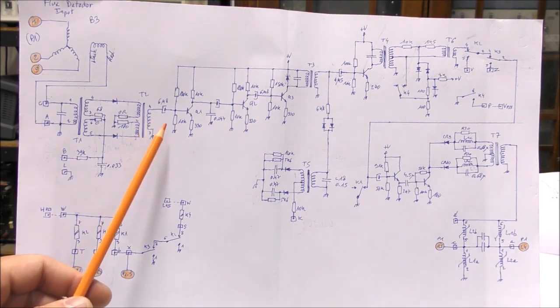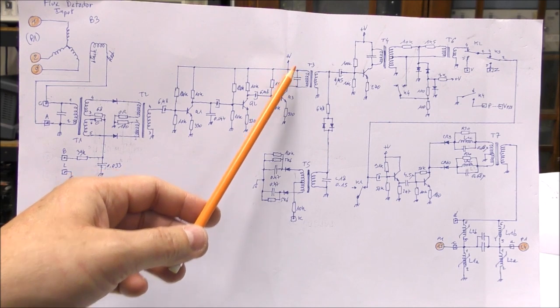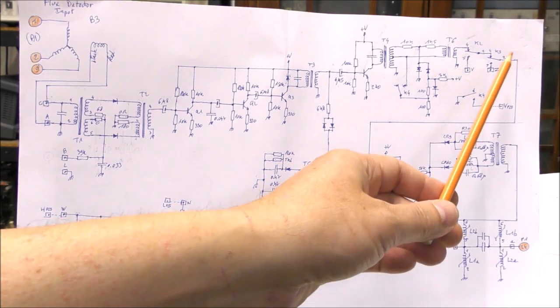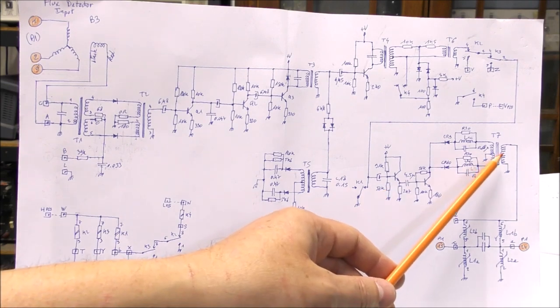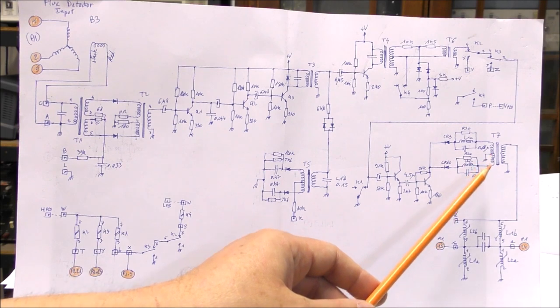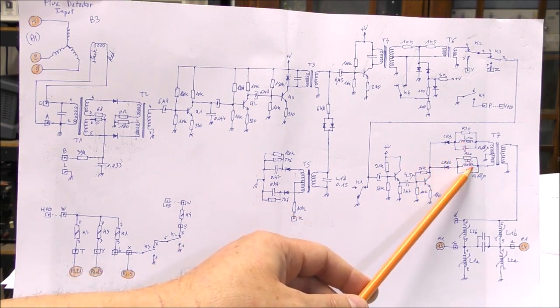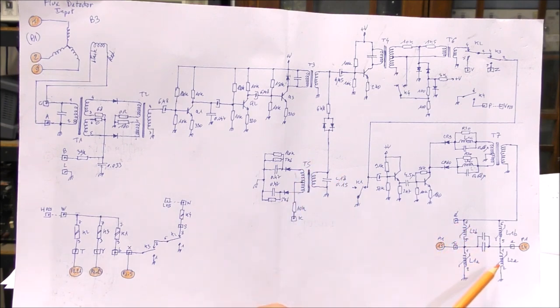This signal is fed to an amplifier made with transistors — there are four stages. A capacitor permits to tune the circuit to 400 Hz, giving an error voltage at 400 Hz. The signal is then fed to the power stage, which is another magnetic amplifier. A transformer delivers two AC voltages out of phase, so a DC current can flow either through one coil or the other depending on the phase. This permits to saturate one pair of coils or the other pair. The output signal is fed to the torque motor of the gyro in order to change the heading using precession.